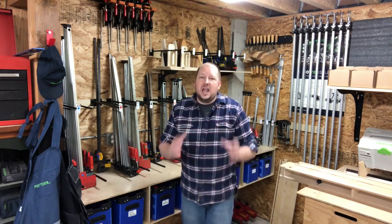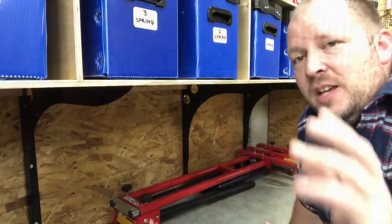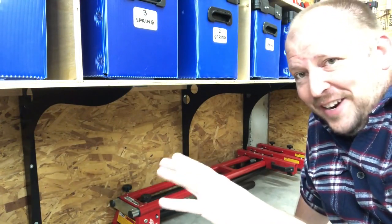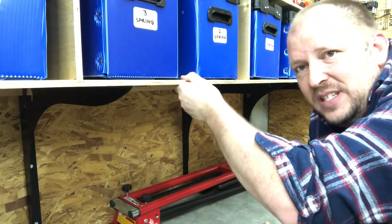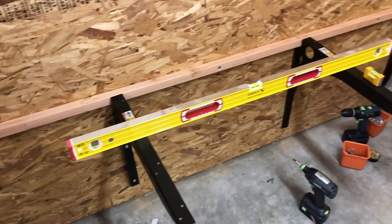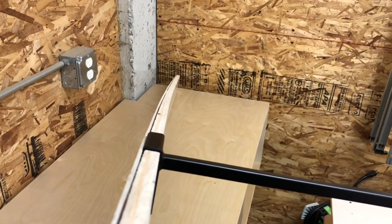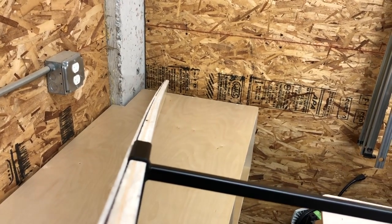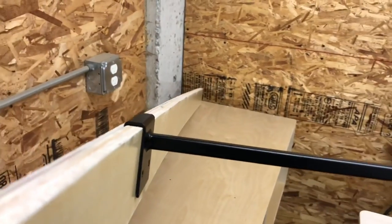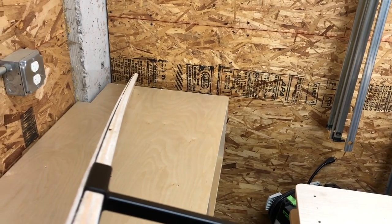Once again, trying to make everything as visual as possible. I hope you like it — if you have questions feel free to ask, and so far it's worked great on several projects with no issues. Down on the ground there are speed braces holding up this entire shelving unit that supports all of these clamps. There's no stress on it, no bending anywhere — this is half inch pre-finished ply. The speed divider just takes some three-quarter stock, cut a little slot in the back half inch by half inch, and the speed divider slides right down in there to organize the clamps.